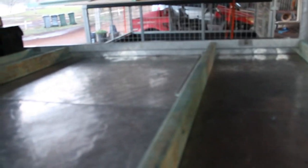Okay, so far what I've done is I've put the extra piece back in the back. It's not going to move. None of these pieces will move. There's no bolting required with doing it the way I'm doing it. I'm actually notching it so it's going underneath there, as you can see. So simple. No bolts required. When your plywood goes on the top of that, it'll lock it all into place.